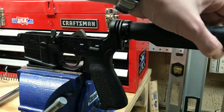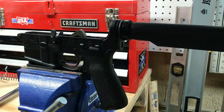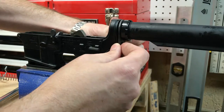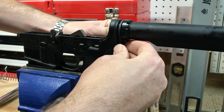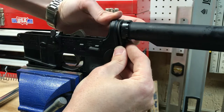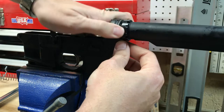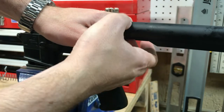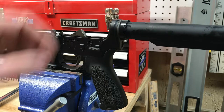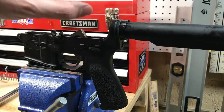What we're checking is that the lip of the tube actually covers the back half of the detent but isn't pressing it in, so it can travel freely and work as needed. Once the tube is in as far as it needs to be, we rotate just a little bit past, open up the gap for the spring, drive that in on top of the detent, hold it back in position, and capture it — making sure we're not bending it. Now with that held down, we can hand-tighten the castle nut into position.